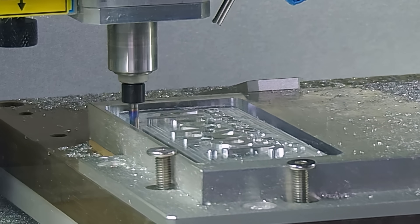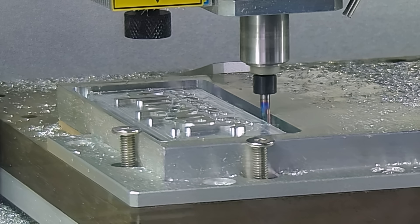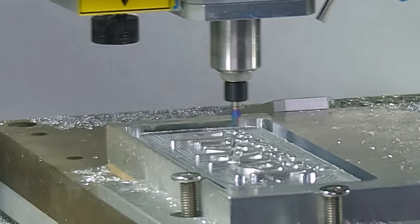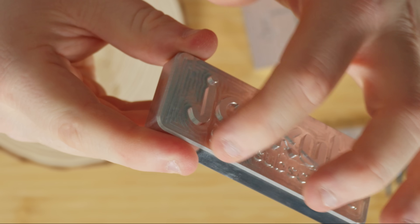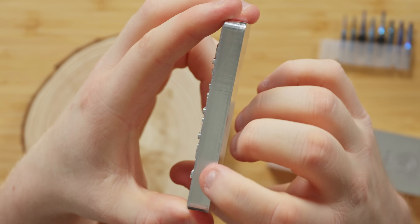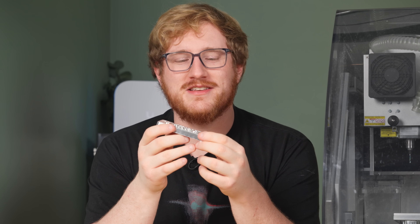I've got this thing ripping at double the recommended cut depth. I'm almost tempted to go faster, but it's so close to finishing the cut — that would be brutal if it broke now. 180%... it's starting to make a spooky noise. I'm going to try 200%. It literally handled double the speed at double the depth I'm supposed to be doing — not bad! It's just cutting out the last little bit at the bottom and leaving a couple little tabs I can snip out. Aside from the giant gouge and not doing a finishing pass on the top, the cuts are pretty clean. Again, it's not uncommon to go fast while roughing and then do a slower cleaning pass — I just didn't do that. It's just a little reminder: measure twice, cut once.